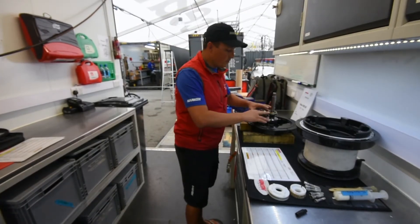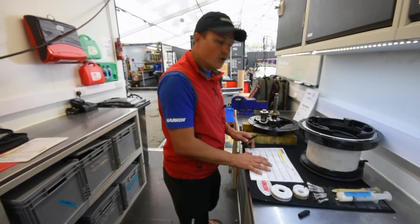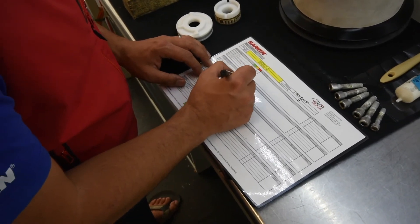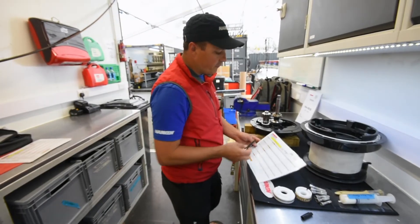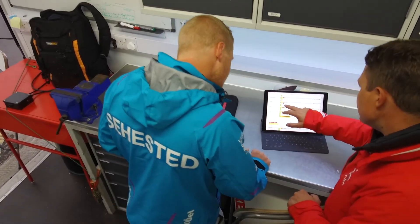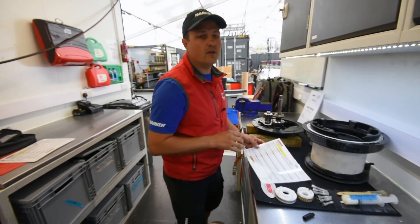The winch gears come back into the workshop here, and as we're servicing and inspecting this, what we're also doing is running through this service sheet and this checklist. It's got a number of different jobs. The first one is a checklist so we can run through and make sure that everything we need to look for within the winch is ticked off. On the checklist itself, we've got a green, an amber, and a red section. Green means everything's okay, and if we see any problems or need to change out a part, we'll tick the red section. This is really nice and visual for the team managers when we submit the report at the end of the stopover, because it means they can just go through each page and look for any reds — something they might need to look at.